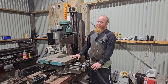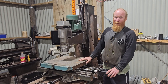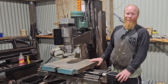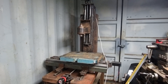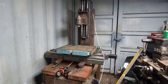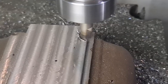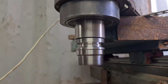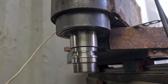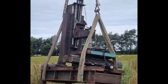The machine's moving pretty fast now, but it wasn't always like that. We'll go back in time and see what it used to be, then I'll show you what I've done to make it move that quickly. This was about the max speed before all the upgrades began — the little NEMA 23 stepper motors were struggling to push that big table and frame around. It did cut steel, but with the homemade BT30 spindle made in one of my first YouTube videos, it cut without too much chatter and left a reasonable surface finish.